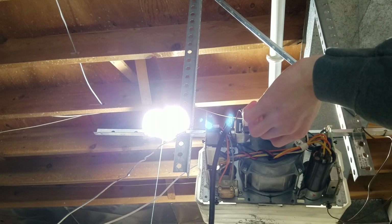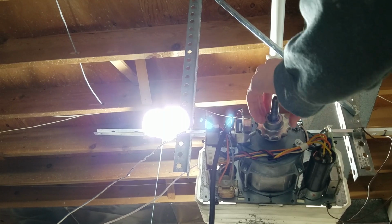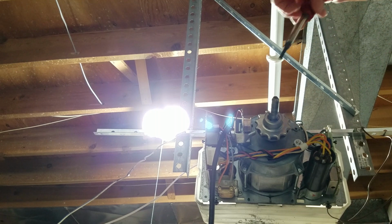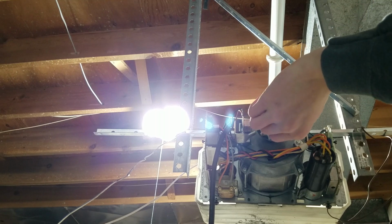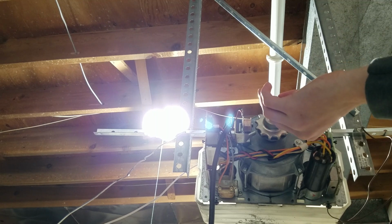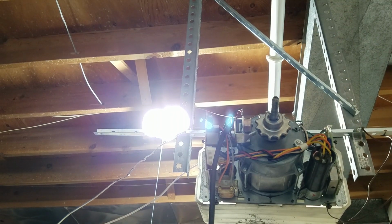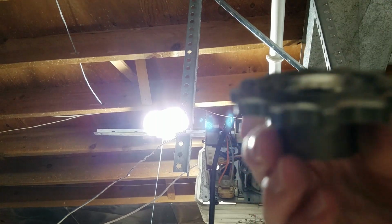And you have another washer after that. And then it's pretty difficult to see. Actually, I doubt you'll be able to see it on video, but there is a tiny little ring here, or a keeper, that's holding the Reluctor Hub in place. So you just got to take that out. This one will take a little bit of effort, but you can see there's just a little ring there. And then this piece will slide off, which is called the Reluctor Hub.